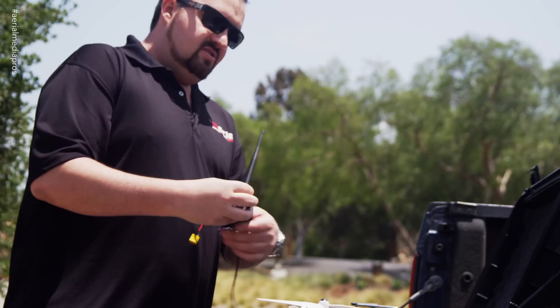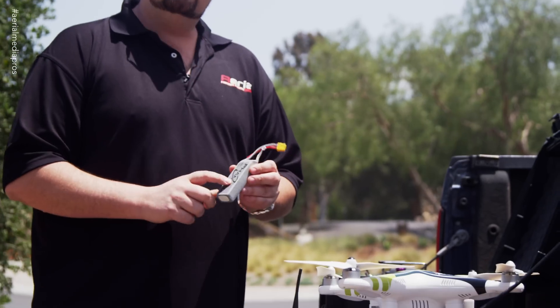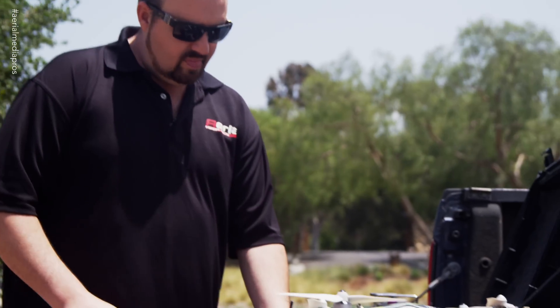I brought my iPad and it fits in perfectly into the case — we'll be using that for the waypoints in just a second. This is the 2.4 transceiver. It's going to transmit and receive the information to and from the copter, and it's going to communicate to our iPad with the Bluetooth system. So the iPad will communicate to this and then this will communicate to your copter. You'll want to use a 3-to-6s LiPo to power your 2.4 transceiver. We include a 3-cell Phantom LiPo to power this and we're also going to include a charger for this battery in the kit, so you have everything that you need.